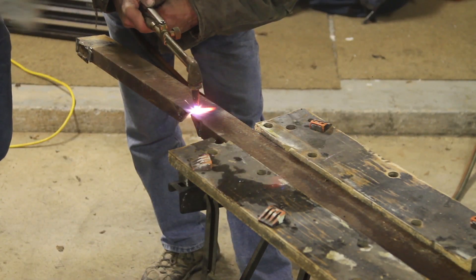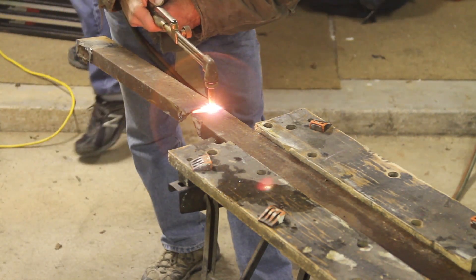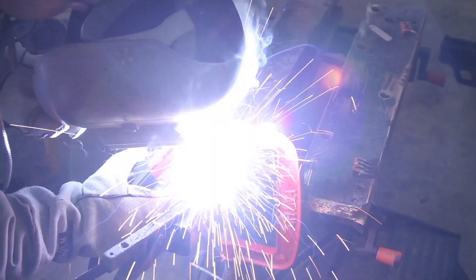The pieces of steel were pretty long, so I decided to heat the steel with a torch and bend two of the corners into a 90 degree angle. So I was able to eliminate some welding as well as making those two corners a little stronger. This would mean I would only have to weld two corners together.